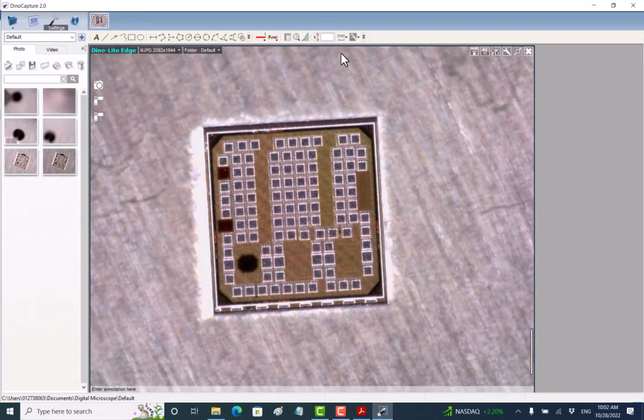And imagine if you want to make a common source amplifier, you don't want to use the resistor as the load, right? Remember the gm RD? That's why you want to add a PMOS. Remember, bias the PMOS as the active load, right? Then it becomes gm (ro,P parallel ro,N), and for that one, the area is going to be very small. Here, you don't see it because the NMOS transistor is actually very tiny, much smaller than this one. Before this class, you are going to do layout for this. You will appreciate how big the difference is. Okay, so that is one thing.